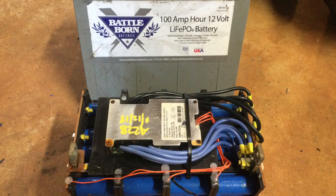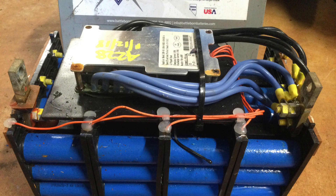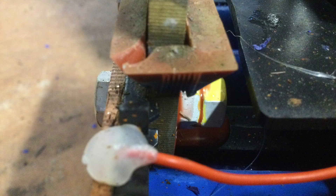I thought I'd go ahead and open them up to see if I could find those issues and harvest any parts. Here is basically the issue everyone's talking about: this connection on the left of the positive lug terminal to the positive bus bar. This connection is made using an aluminum threaded bolt, and between these two metals is the plastic cage for the cell module, being sandwiched by these two metals and this bolt.